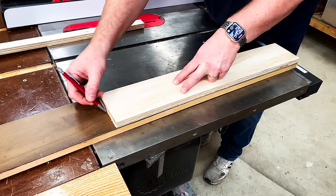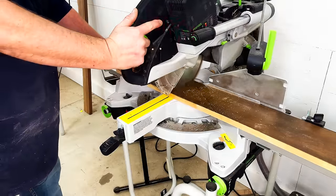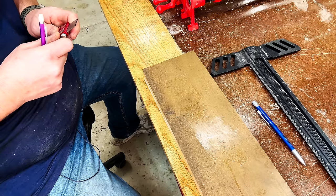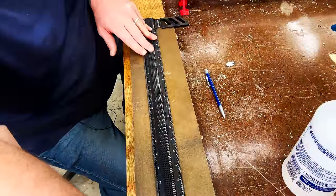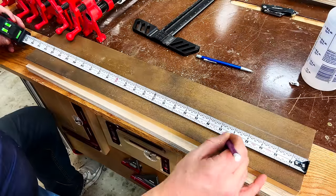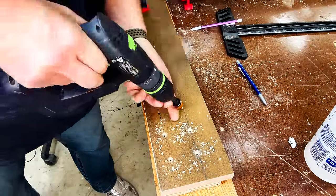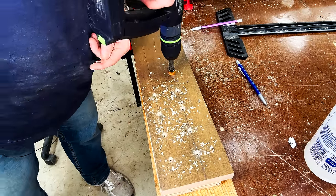Since my poplar is a little bit long, I'll use my plywood to make a marking and cut it down at the miter saw. With both pieces cut to size you can see how they'll fit together once laminated. On the poplar I'm striking a line at two inches, then adjusting to one inch on the other side, and carrying those lines across the entire piece with a T-ruler. I'll put a small tick mark at every two inches along both lines, then pre-drill and countersink a hole at each tick mark. I'm probably over-building this, but those clamps are really heavy.